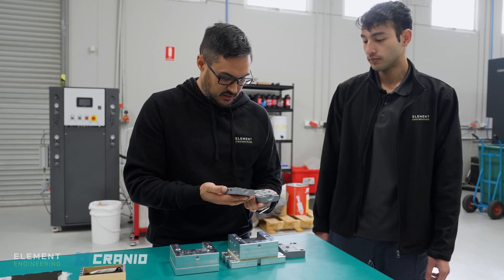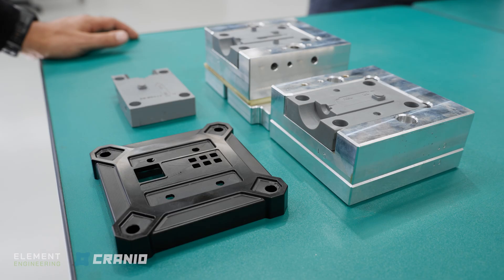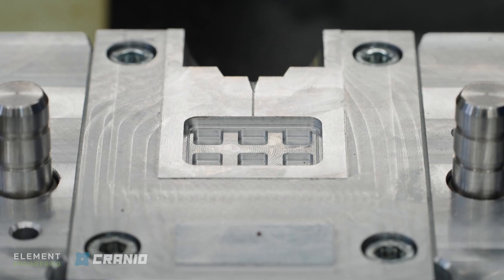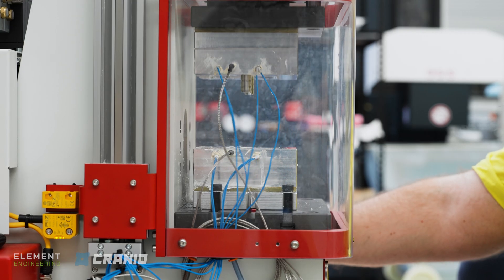There are some really nice materials we can use to do this sort of stuff but it's a bit more exotic than we want to do. We're happy to go back to our aluminium moulds. Aluminium has got extremely high conductivity so it's perfect for this. From memory, getting the aluminium to 180 degrees only took less than 10 minutes.